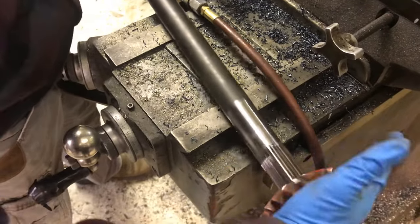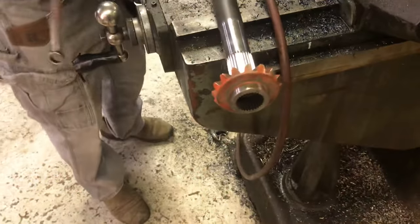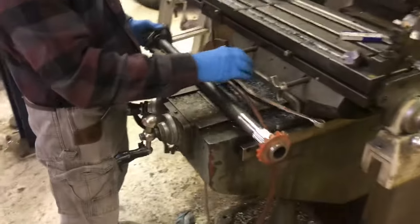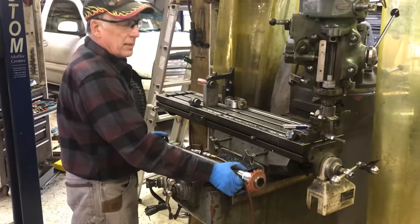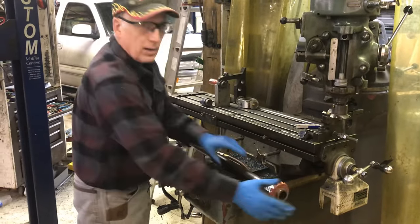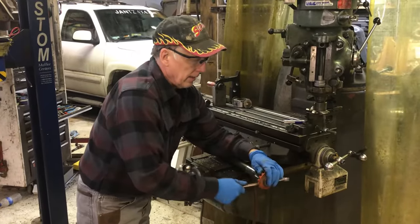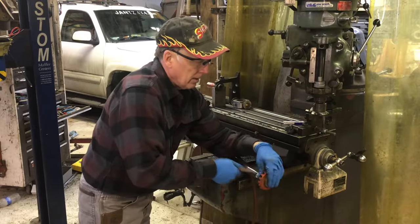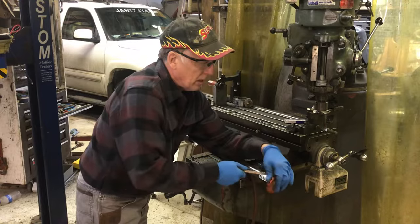It's a little tight. I'm going to have to go around it again — I'll change this about two thousandths. You don't want a press fit because as your front end or rear end goes up and down and flexes, you don't want it twisting the spider gear inside your air locker because it chews them up. But I'm not going to bore you with going around it another 30 times. This video is all about how I spline it.